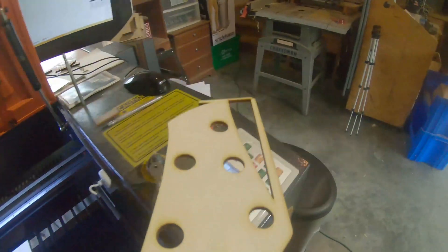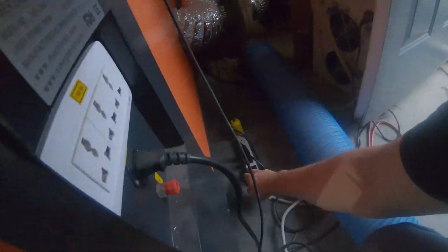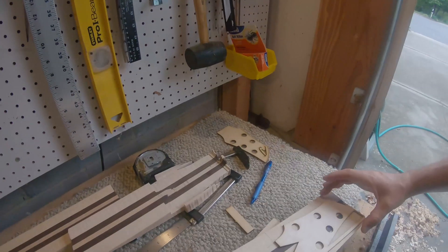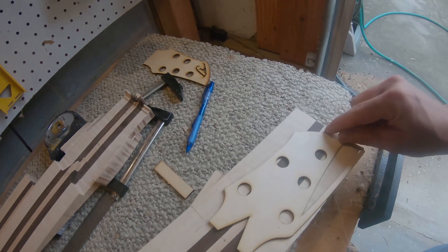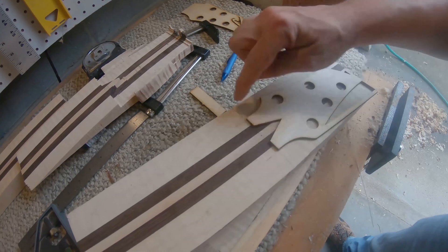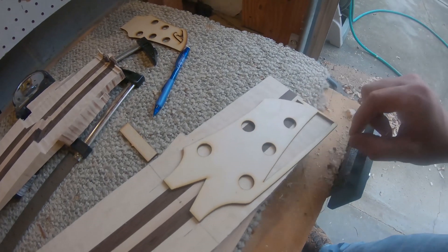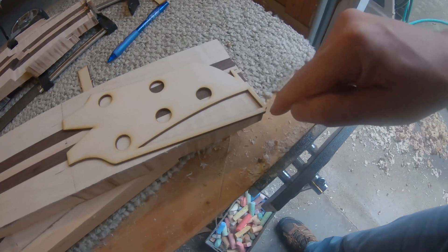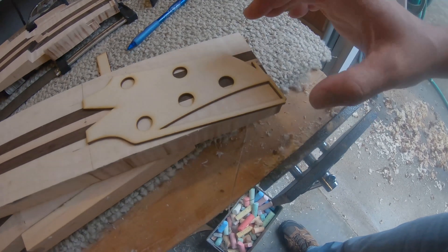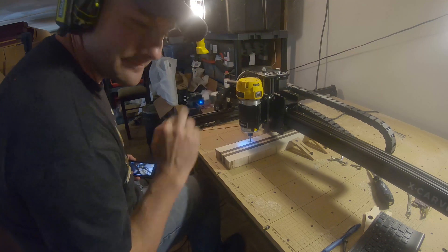So here it is. Let me shut the laser off and the other noise. I've got the center point alignments here — I just want to get those lined up with where the nut is projected to be and then I've got my center points. This is where I'm going to align the tool with every one of my processes, and then that gets cut out. Here we go with the second round on the CNC machine.